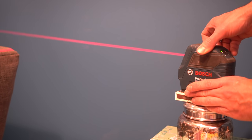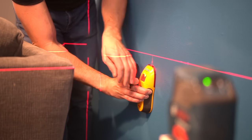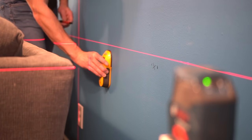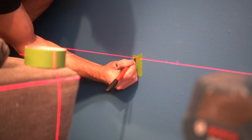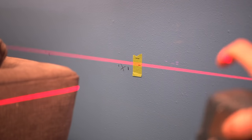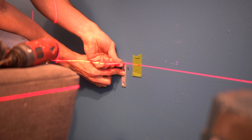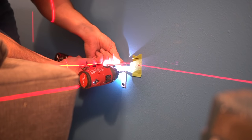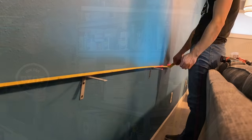I set up my laser level to the side of the couch so I know exactly where the height of the shelf should be. I then grab my stud finder and determine the exact location of every single stud behind the couch. I make a mark where the shelf height is and then account for the thickness of the shelf, which is where the brackets need to be set. At this point, I can easily align my L brackets exactly where the studs are, as well as account for the exact height through the laser level. A good laser level will definitely cost you, but it's worth its weight in gold. It's one of those tools that makes life easier, and I'll leave a link in the description box below on where you can find this one.